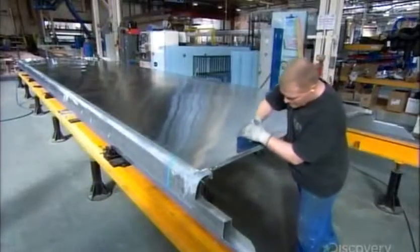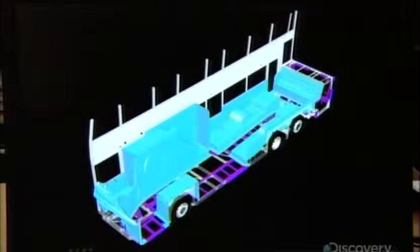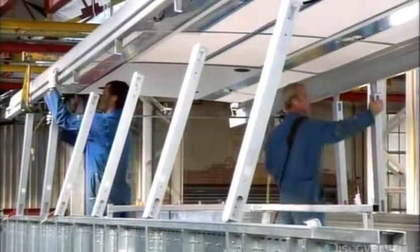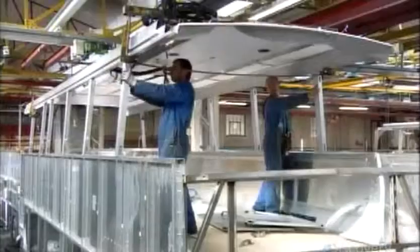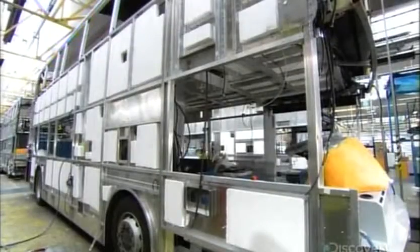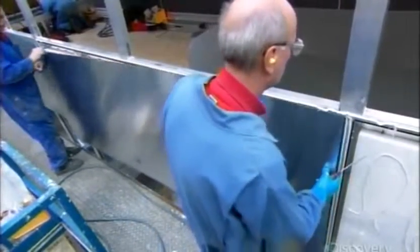Next, they paint the roof and install components integrated within it, such as the aerial antenna and wires for lighting. Workers insert the pegs underneath the roof into aluminum pillars running the perimeter of the upper deck. Along the sides, workers sandwich the structural frame between inner and outer aluminum body panels — first they affix the inner ones, then fill the spaces in between with blocks of foam insulation. Finally, they glue on the outer side panels, pressing out the excess adhesive with a roller so that the panel lays flat.